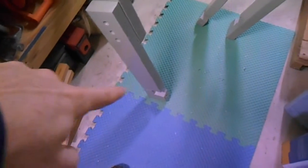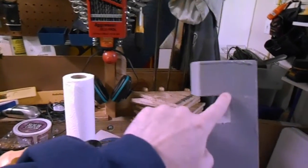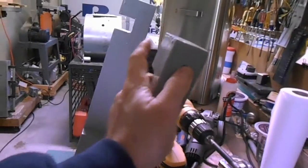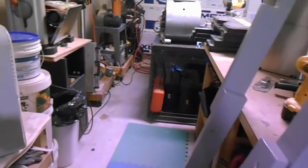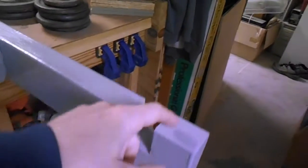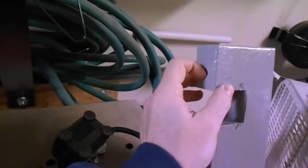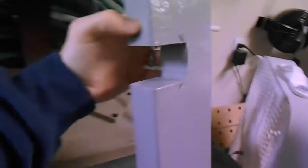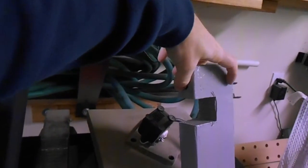Given that this is kind of a weak grain situation, I went ahead and after gluing it, I drilled and sank in a three-inch drywall screw, and I've done that on both ends. Then I took the other members that have the same kind of possibility for weak grain cracking and drilled, countersunk, and put in a three-inch drywall screw to give some extra support and keep those from cracking. This one is labeled as front bottom. Rather than drill from the top side where I could get a pool of water and rust, I drilled from the underside — that's what I did with all the 2x4 members I've reinforced. I'd recommend putting a long decking screw or wood screw in there to reinforce this and avoid that problem.